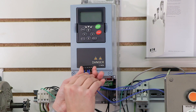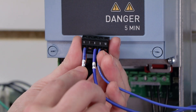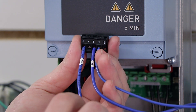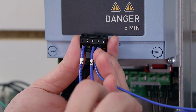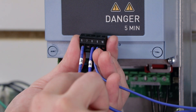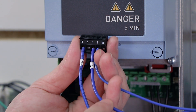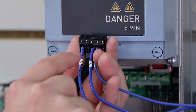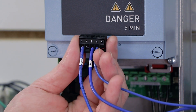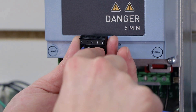So if I actually pull that terminal you can just wiggle it off and pull it off the drive itself. We can take a look at the terminals I have here that are wired. Terminal 6 has our plus 24 volt control voltage, and I have this going out to the common part of my switch. Then on the other side of my switches they are switching the voltage to make it flow from terminal 6 into terminal 8 — this is my start forward as we saw on the diagram. So my forward switch is wired there, and then for my reverse switch I have the plus voltage coming out from terminal 6 to terminal 9, which when that closes the voltage will flow there.